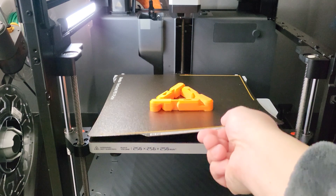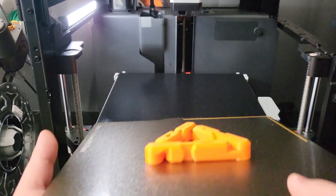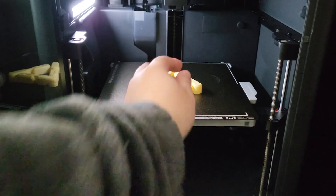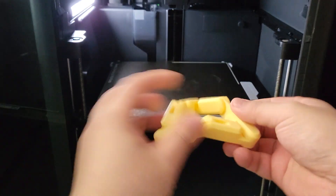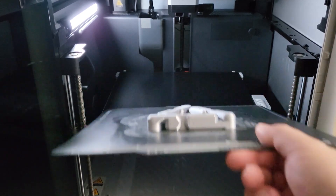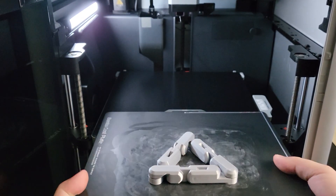You also need to pay attention not to overload your circuit. One printer uses around 350W during the initial heating process. One 15A circuit might only safely handle heating four printers or fewer at the same time. We have now explored the basic workflow for the Panda Touch.